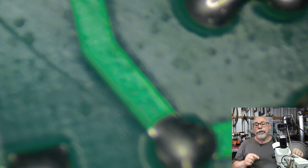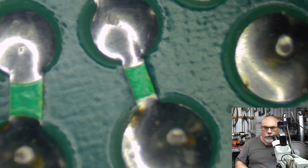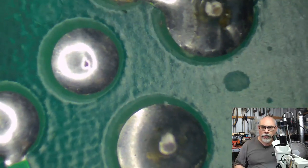And on a Mac Plus board, if no work had been done to it, I would expect several cracked solder joints. But as I've just jumped around here before, I've noticed that they look like they've already been done. That's good in that it makes life easy for me, but bad in that I can't demonstrate a cracked solder joint.